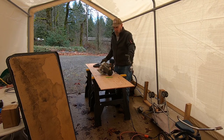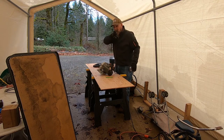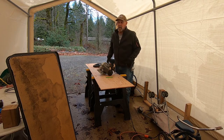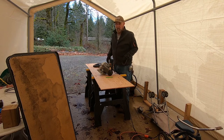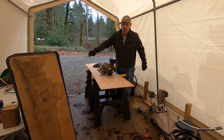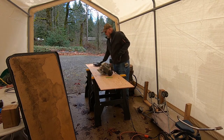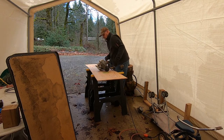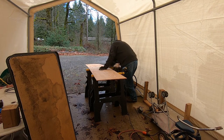I'm going to just cut off the end here, get myself down to the short piece, and then I'll round off my edges. Cut it from the back side if you can. If you can't, get yourself a really fine blade and go really slow — that does less damage. Another trick is to put tape along the line, put some good masking tape along the line; that also helps keep it from splintering up. Also, the blade rotates in a counter-clockwise rotation for safety reasons, to keep the saw from running away from you.